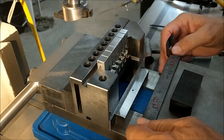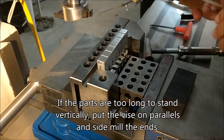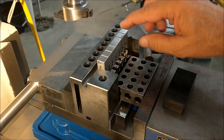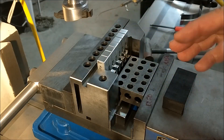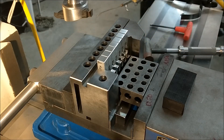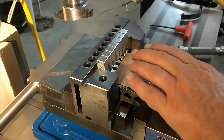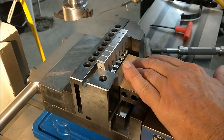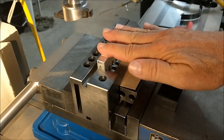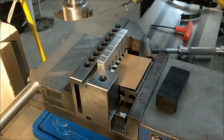Second set of parallels with the spring. Clamp block to apply pressure to the parts. Now anytime you gang up parts like this you cannot trust them all to be the same thickness, because stock does vary a little bit. Maybe you got two bars, maybe you got pieces rotated from how it was extruded. Good way to take that gap up: cardboard from the back of your notepads. Lock it down. You can access both sides, front and rear.